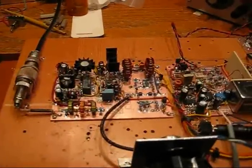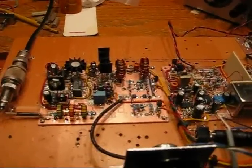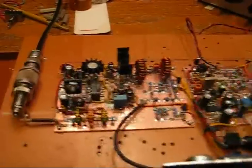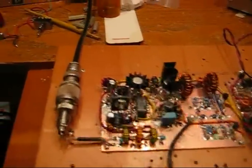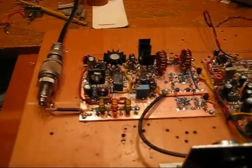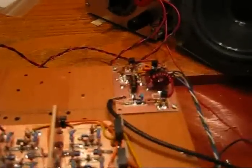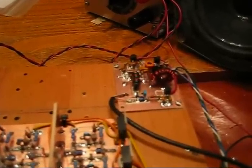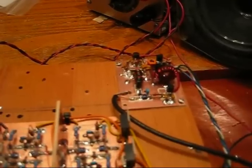This board here has got a series of two bilateral amplifiers either direction, a bandpass filter, the receiver RF amplifier, and over here on this side of the board is the transmit amplifier and the low-pass filter. Up here in the upper corner is the varactor-tuned oscillator — a SA612 followed by a TriQuint AG303-86G.